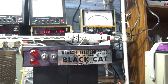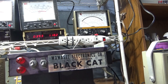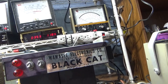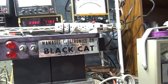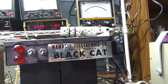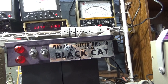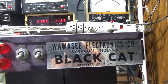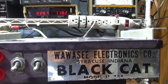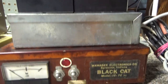Over here on top is a one-piece JB 75A. The JB 75A is a one-tube amp using an 8417, which is the high-powered version of the 6L6 used in the Tram. All these JB 75s and JB 76s use either the 8417 or the 7581, which is another high-powered version of the 6L6 — basically the same tube with just a slight difference. The one-piece mobile does about 75 watts peak and about 20 watts dead key or less.